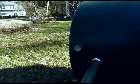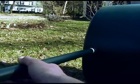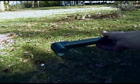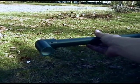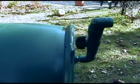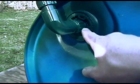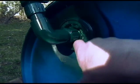This overflow port, as you can see here, that's just the coupling part, but it's going to go in like this, and then at the very end it's like a 90 degree angle piece, and it should just bring the water farther away from the house so you're not getting water near the foundation, which can result in what we have, a flooded basement usually in the spring times. The 3/4 inch bit, as I mentioned earlier, is going to be used to drill through a hole in the bottom of this, or top of this bunghole, to get the water to actually come through the PVC and out.